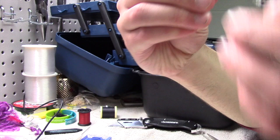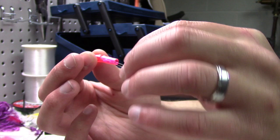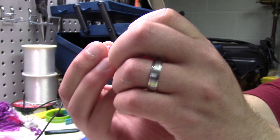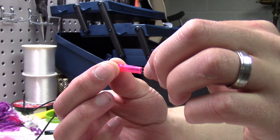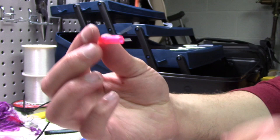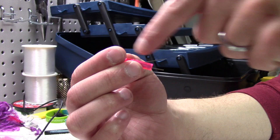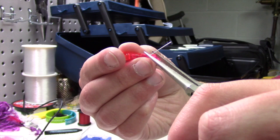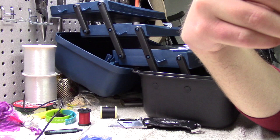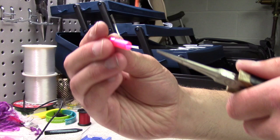Have the LED with the long leg on top, and hold the nock so that hole is facing up. Put this LED in — remember, I didn't need to cut the hat off, but you might have to — so it's firmly wedged in there and won't twist. I have that long leg of the LED facing up along with the hole. Now I'm going to take that long leg and start working it upwards through that groove — just the long leg, working upwards through that groove.